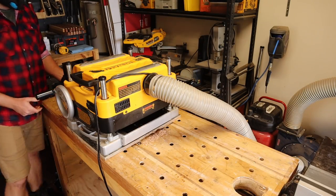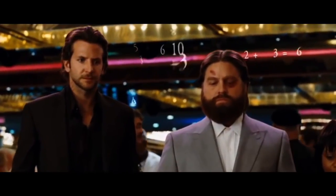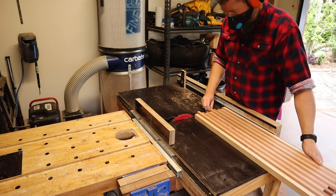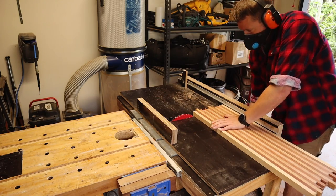Let's call it 14. Now I want my board to be 35mm thick, so 14 times 35 is 490. When we add the saw kerf it becomes 532. Essentially I now know that if I make my panel 540mm long, I'll have enough timber to make my board exactly how I want it.